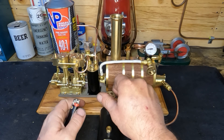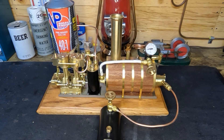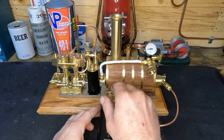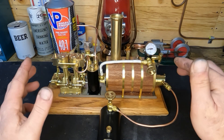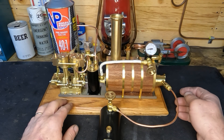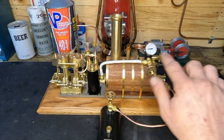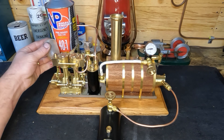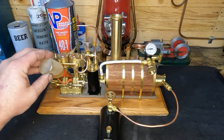Turn the fuel on — it lit very easily. We'll keep the fuel pinched back a bit. They do make this model with a steam pressure regulator, but this is what we've got. While it slowly warms up, keep an eye on the gauge. We're going to oil everything up — starting with the main bearings, which have very nice oil cups provided.